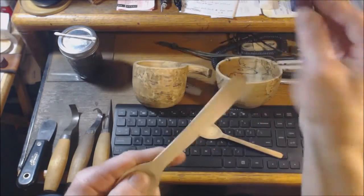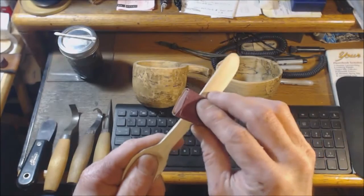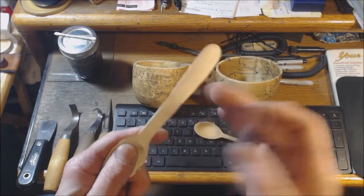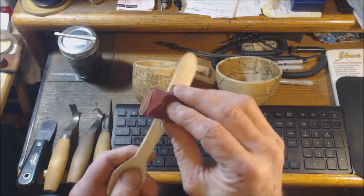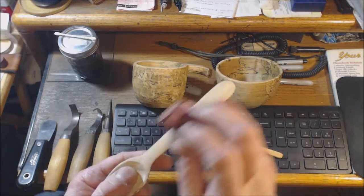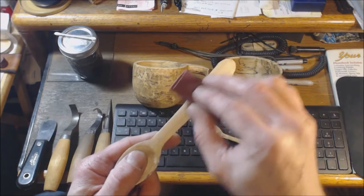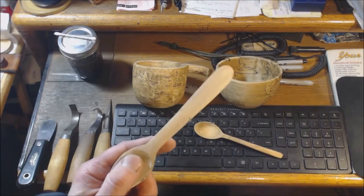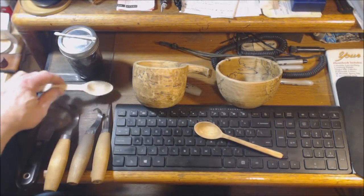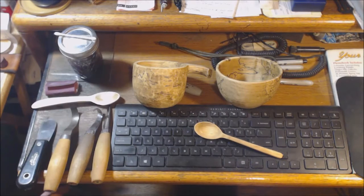If you're doing a sanded finish, these are better than just sanding by hand, because when you're sanding by hand, your flesh is much softer than the eraser, and you can get dips and humps in it. But if you're wanting to flatten something out and get a good smooth surface on it, you need something with a backing pad that will ride on the high spots and sand them off to get those high spots down even with the low spots. And we're going to talk about getting rid of those low spots next. I'm going to cut away for just a minute, and I'll be right back to talk about that.